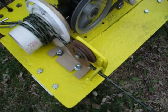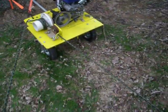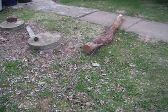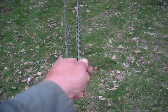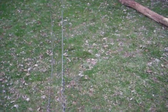I've tried this with a 3/16-inch line up to a half-inch line, which is what this is right here. I'm going to walk backwards. As long as I keep pulling on the rope, here comes the log. It's not coming quite as fast as I'd like, but it looks like it's going to take the load. This log weighs almost a hundred pounds, and I'm just pulling with one hand, just enough to keep the line tight. I'm hardly holding it and the capstan is doing all the work.